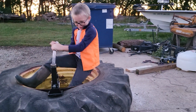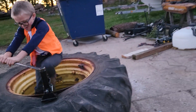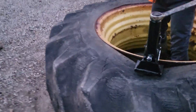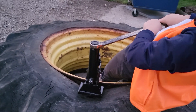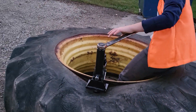You're a hard worker, buddy. On the backside we only had to do it in one spot before I was able to pop it completely loose, but honestly if I have to do this in two or three spots and only spend 20 minutes popping this thing loose, it's worth it to me — definitely worth the $80. You can see right down there it is just working away nice and easy. The hardest part so far is actually getting it on the rim. This is an 18.4 by 30 tractor tire on a rusty but trusty John Deere 2440 from 1976.